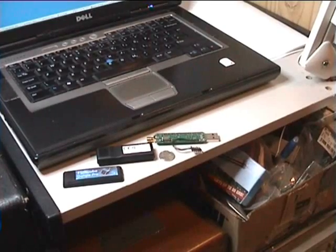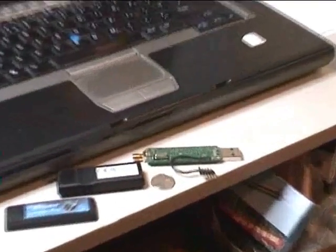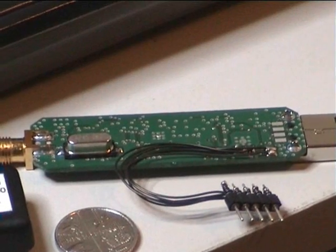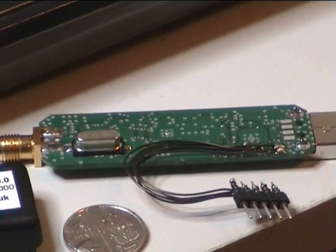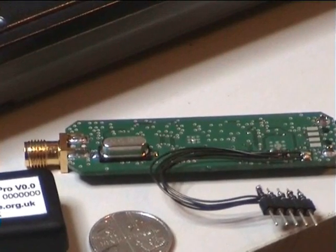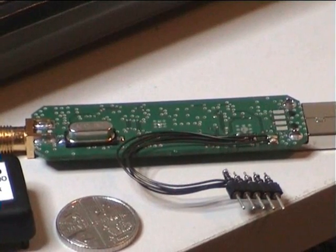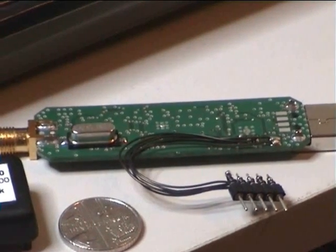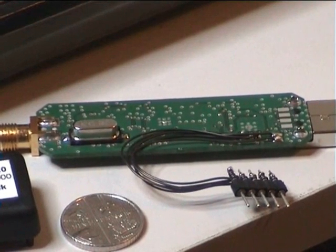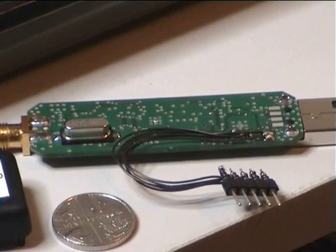We all like to see what's on the other side of the board, so I've taken it out of the case here completely. You'll see this is the reverse side of the board — there are almost no components on it. There's the crystal here, pretty much because I couldn't find enough space on the other side. You'll also see here there's a debug header that I'm using, because we're still in development mode. This allows me to put my in-circuit emulator on so we can debug the code.